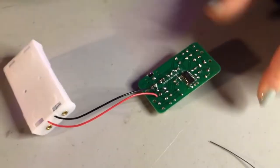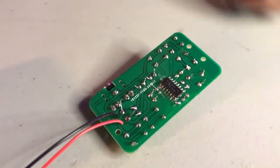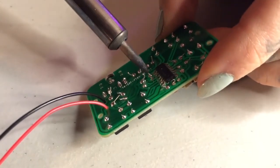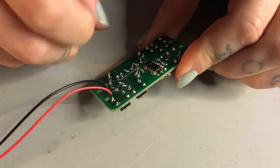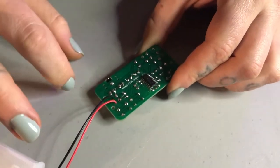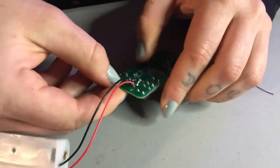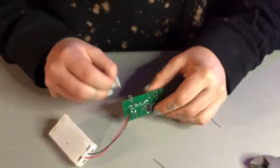Let's go through and make sure we've got all of our solder points covered. It looks like my crystal could use a little bit more — I'll give it a little more dab. Everything's looking good. Also make sure there are no excess wire pieces lying around; I just found a cut piece of wire. Make sure none of the tips are touching — my negative terminal was touching one of these components, so I moved that over. Looks good.